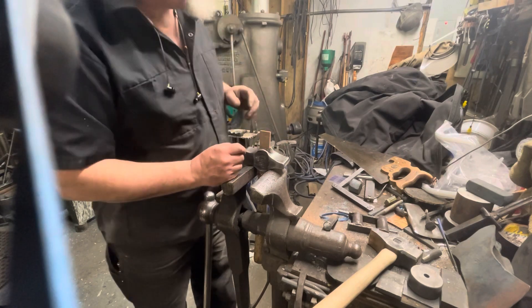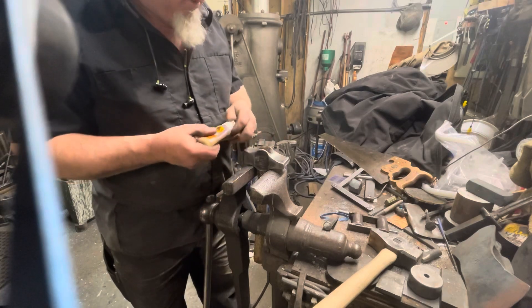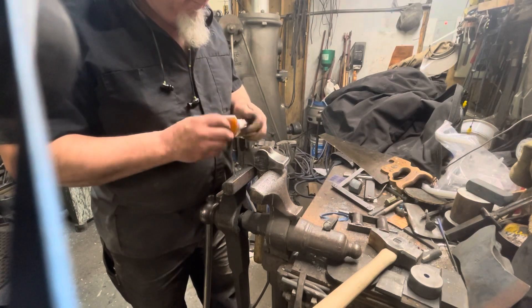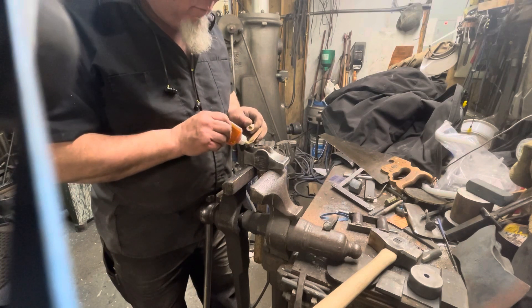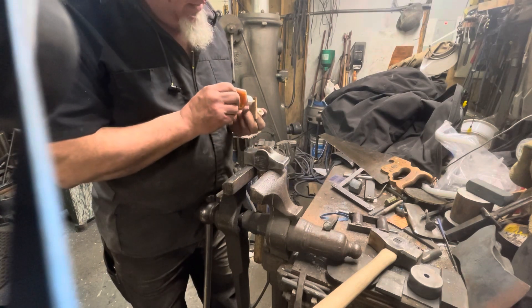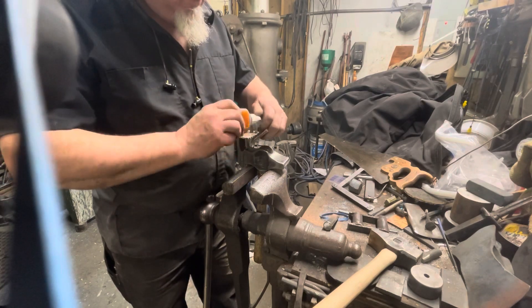So now I can be ready to put in my wedge to its correct depth and know when to stop. I like to use polyurethane glue — not to join the wedge to it, but to keep it there. Sometimes the polyurethane glue gets on the steel and people have confused that with me trying to glue the handle to the steel. It's just a little bit of run-over and doesn't hurt anything.